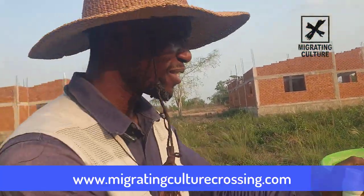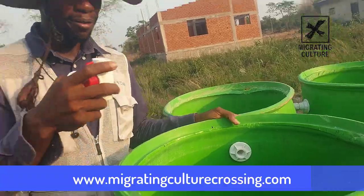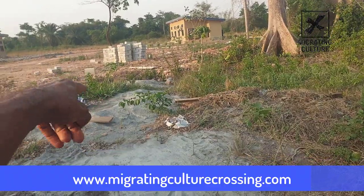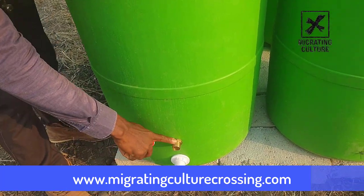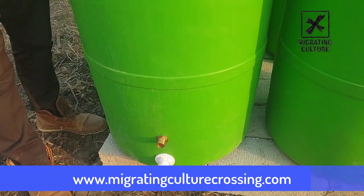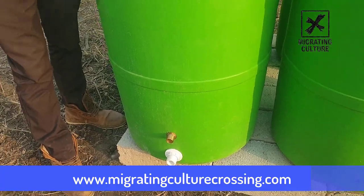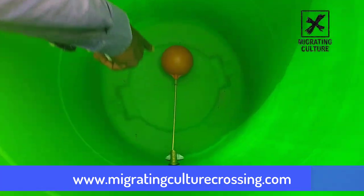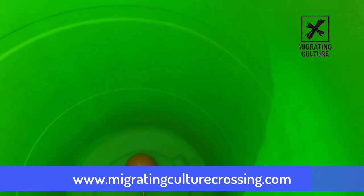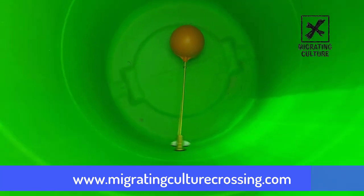Alright brother Fofo, we've got the four barrels — explain to everyone how this water filter is going to work. So the water is going to flow directly from the borehole into the first barrel. There's also a backwash — over time, when the dead sediment builds up, you open that and let the sediment out to clean it. Then in this tank we have a flow control valve that determines when it's full so it doesn't overflow into the media tank.